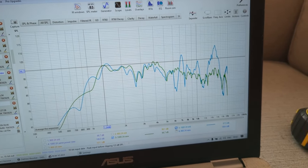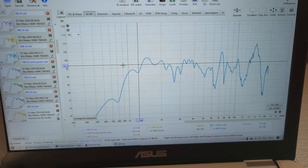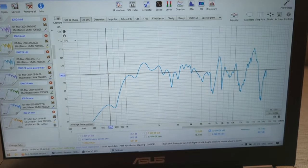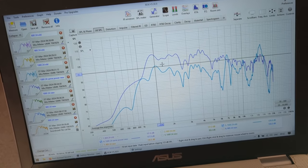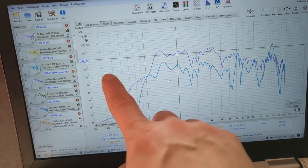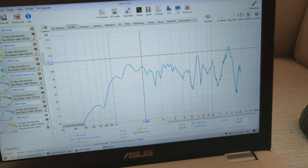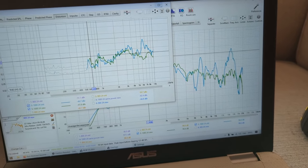The new one trends down but a shallow 6dB slope will take all of that out - much smoother response compared to the old one. I tested at exactly the same level - about 95 to 100dB because these horns are loud. When I swapped drivers and just reconnected the wire without changing power at all, the Celestions were 8 to 10dB louder - I nearly went deaf at 105dB.